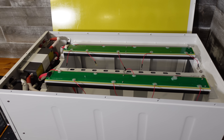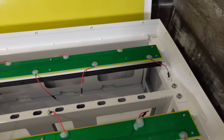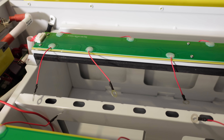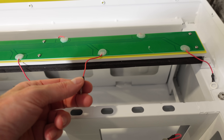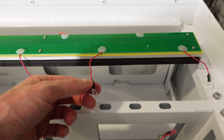Let's take a look inside the case. The lid is protected with a layer of epoxy board. Inside the case, the cells are oriented in two rows of eight. There's a support bracket running across the top, and on top of that support bracket we have a PCB — a printed circuit board. The PCB has a number of red leads coming off it; these are the balance leads, so one of these will connect to each of the series connections between the cells.